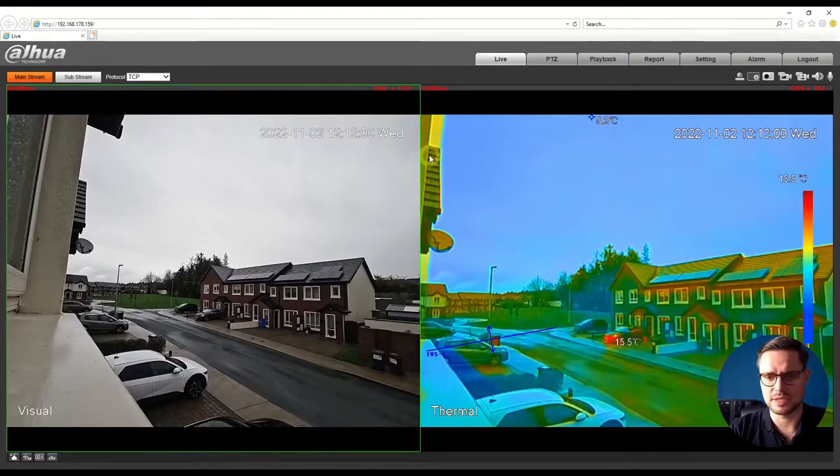This camera could be installed in a pitch black environment, at a substation looking at wires, or at any machinery that is heating up — so you can switch off a machine automatically if the temperature threshold is reached. You can also use intrusion detection and line crossing, depending on your environment and the solution you want.